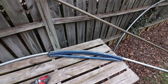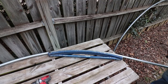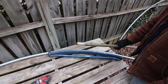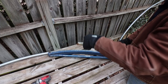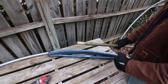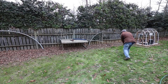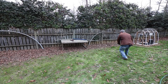Each time we go in a little more we want to touch the bender firmly but not go past it. Now I've got to attach that second pipe to the end of it. These top rail pipes have a narrow spot on one end that slides into the next one — that's how they get attached together. After I'm finished I'll put a screw in to hold them together, which I'll show in the next video as it will also support the purlin — the piece that holds these in place. I'll slide this one onto the end of the other one to gain additional leverage and then continue with the same pattern, going in about four to six inches and bending it to shape.